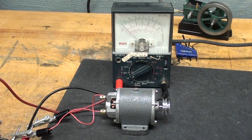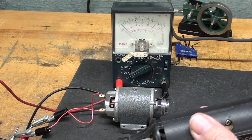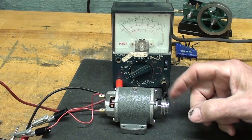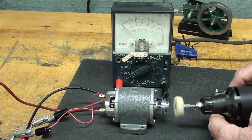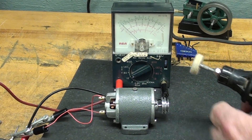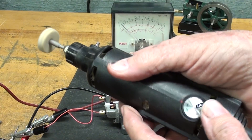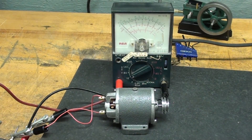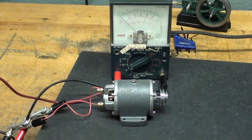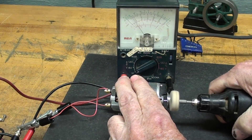Remember, the dynamo is rated at 5,000 RPM, and I really have no good way of measuring that at the moment. But I did take my Dremel — and you know, these things run at an incredibly high speed — and hooked it up, since this is an eighth inch shaft, hooked it up to the eighth inch collet direct. But I really need a flexible coupling, and it worked fine, but it's just most awkward. So I put a buffing wheel in here to rub up against the pulley here. Watch the voltmeter — I have it set on the 12 volt DC scale, and this is adjustable for RPM. Plus I'm also running off the other Dremel speed control here, so I have double control because it didn't really go slow enough.